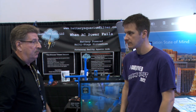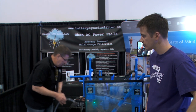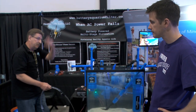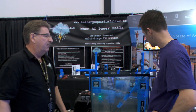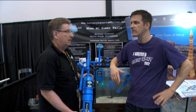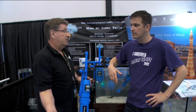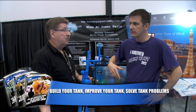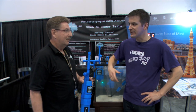There's also a sump version — it sits in your sump with a tube hanging over the tank. When the power goes out, it pumps water through your sump into the tank and the overflow continues. This particular model can be disassembled and converted to the sump version as well. It gives you a solution better than a bubbler, not as good as a generator, but much less expensive — and unlike a generator, this kicks on automatically. Most people don't have their generators tied into the house, so when they go on vacation, somebody has to go there and turn it on manually. This goes on automatically. I need one of these in my backup arsenal.